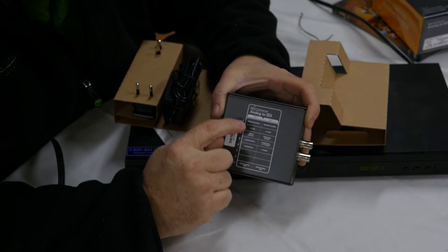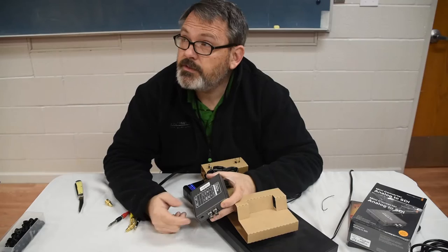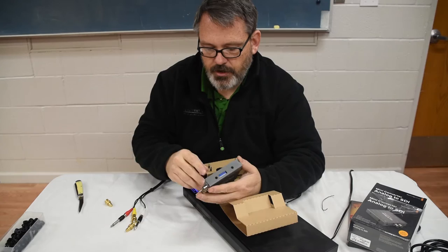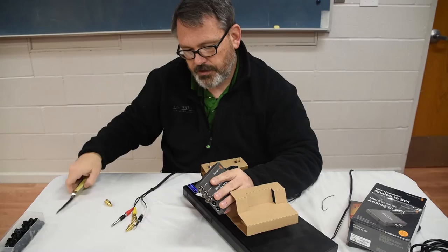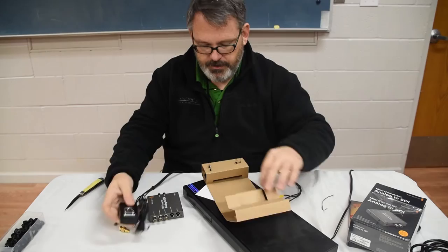Number 8 is analog audio versus AES-EBU digital audio — I need 8 off. So I need: 5 on, 4 off, 8 off, and everything else I'll leave where it is. The dip switches are numbered 1 through 8, and there's a little arrow that says down is on. All of them are off at this point. I just need to turn 5 on. I'll take Papaw's knife and flip switch 5 to the on position.